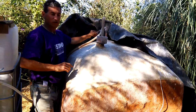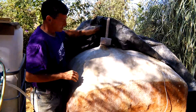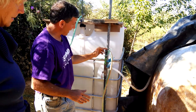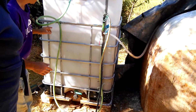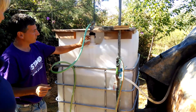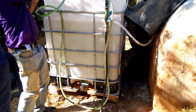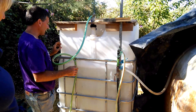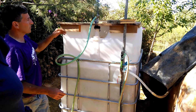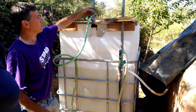As you can see here, there's a valve up here. If you needed to, you could close off the biodigester from there, but we leave that normally open. It's feeding to the stove, but the stove is closed, so it's coming back up this elbow and down through here, up through here, and into the gas holder tank, which is made of an IBC turned at a 90 degree angle. This is the drain valve of a typical IBC — that's the normal drain valve — this is the same thing rotated out. So this is floating in water; there's water up to here and you'll have to top that off occasionally. This is normally kept open — if you wanted to isolate this, you could close this valve and now the gas can't escape, but you can't fill it either. So this is normally kept open, and then it fills.